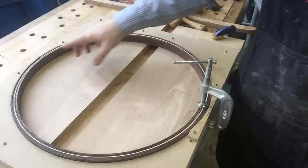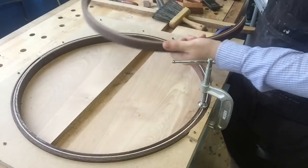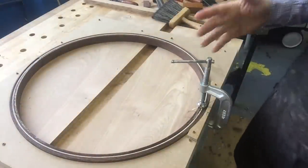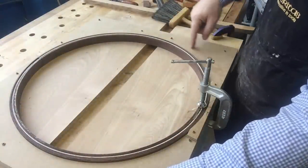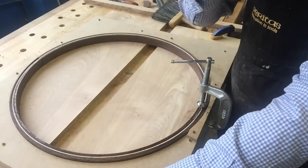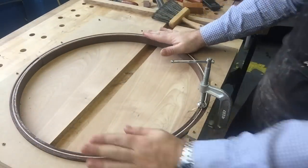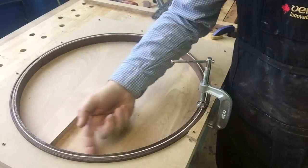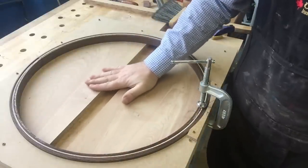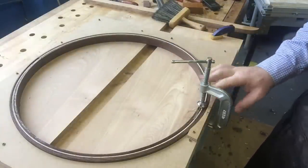This is the next stage of joining the two semicircles together. Once you've cut them to length — you can cut one and then cut the other to fit it perfectly — I've cut a circle out of this piece of MDF and the circumference is the exact same size as the outer circumference of the circle. Squeeze that in there, plane up the lower side so it sits flush and level on this piece of veneer chipboard, and then put a clamp here just to hold it down to make sure it doesn't flex when the drill goes in.